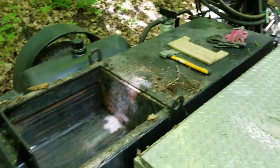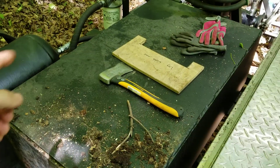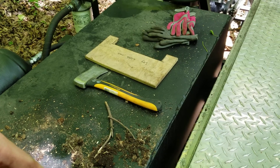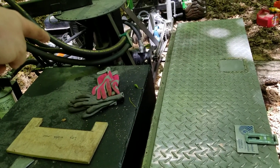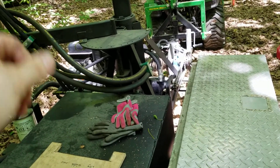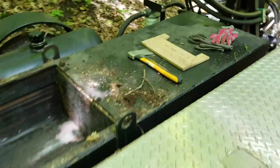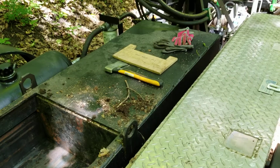Most all of this is 3/8" hot rolled plate steel. The pusher surface here is 1 inch, and inside is a box that's all 3/8", and then there's some gusseting inside of quarter-inch as well as on the end. The back plate is 3/8" as well, but there's a 1 inch plate at each connection point for the cylinder. It's a 24-inch stroke and a 4-inch diameter.